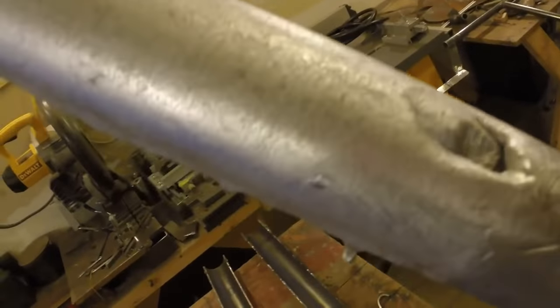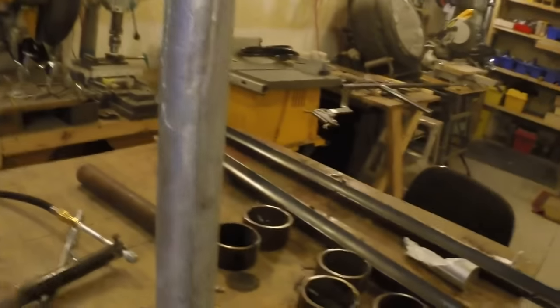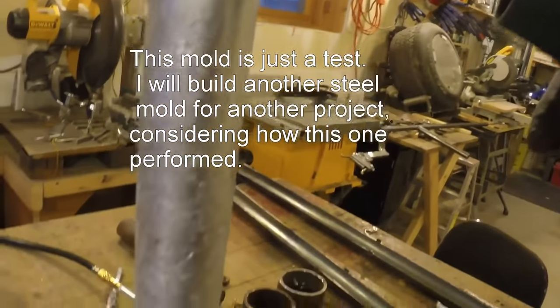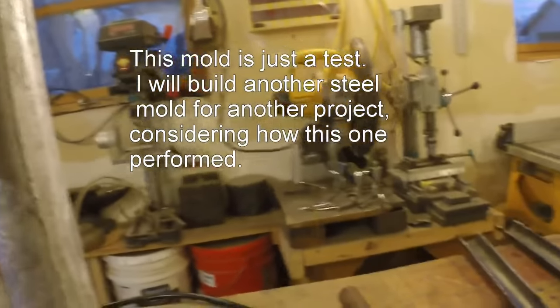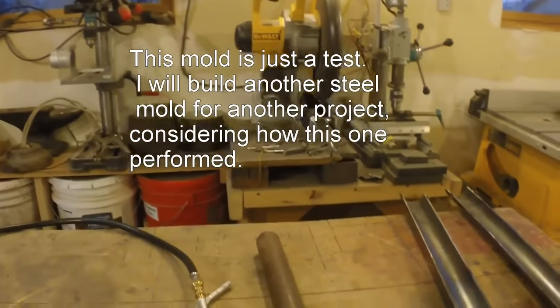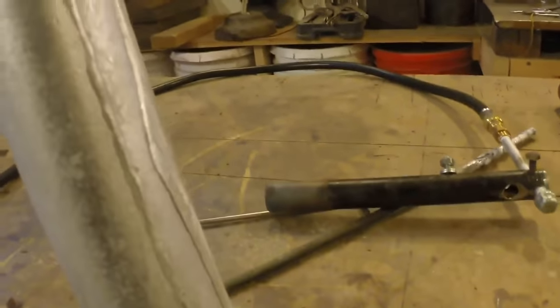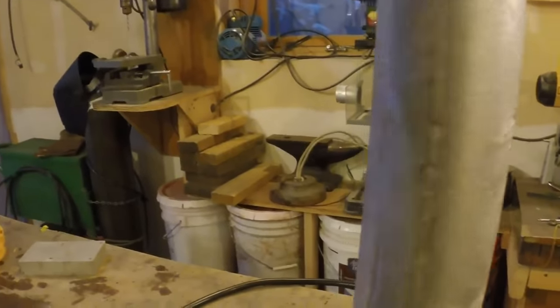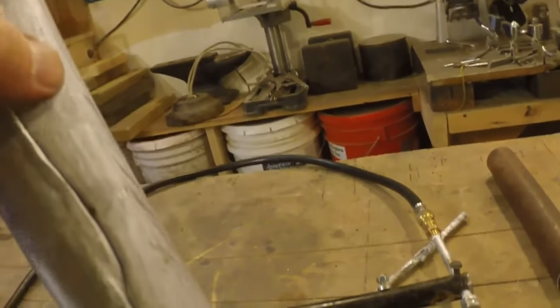This is where I stopped my pour, that little defect in it. But look how nice that is. That could make so many things. Even if it was a relatively poor casting, it could make a lot of different things. And it's not a bunch of muffins in a 5-gallon bucket that are hard to get to. So I'm pretty happy with it. And you can see the flash on either side is non-existent, and this is the two pours.